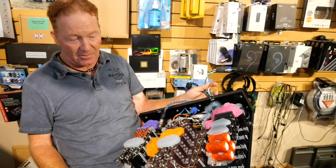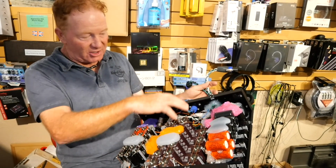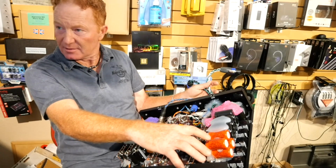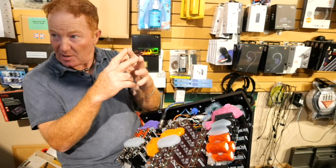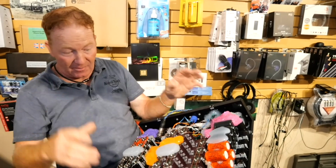Can you imagine? Most amplifiers have 2 of these and that's it. And we're doing 3 sections. One section for power, one section for line stage, so the signal, and one section for the tube filament, because we have an amplifier that uses tube and line together, and it's paralleled, and we can adjust how much tube and signal, and then we have a main gain. Quite an amplifier.